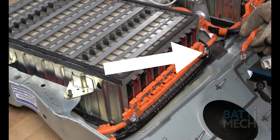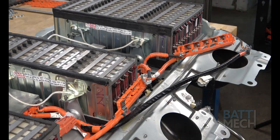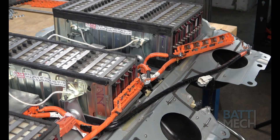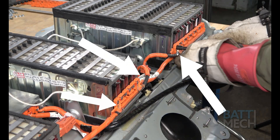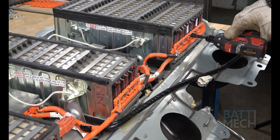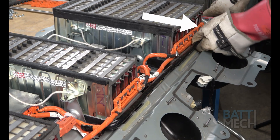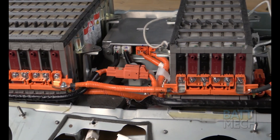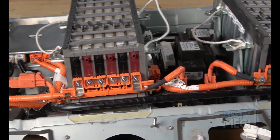Don't forget to reattach this wire to the harness as well. Repeat the same steps for attaching the orange wire harness for the next two packs. Be sure to attach all the eyelets pointed out to complete the circuit — don't forget the last eyelet. After completing the attachment of the three orange wiring harnesses to your three battery modules, your wiring harness should look like this.